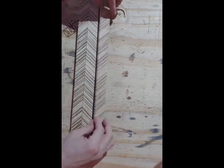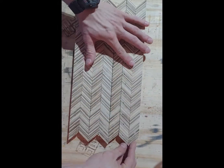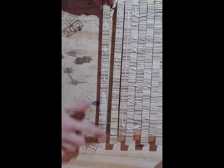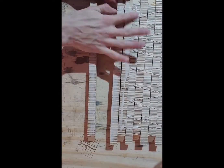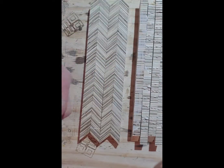The reason we cut them on a 45 is so we could alternate them to create that herringbone pattern. One did break apart but that kind of happens with plywood so I just glued it back together. Then you just turn them on the side and it's rinse and repeat. I'm going to glue the top using Titebond 3 — just ladder these up, spread them out with my finger, turn them back on their side, push them together and clamp them up.